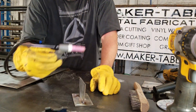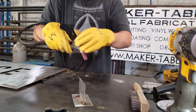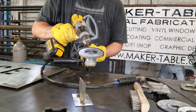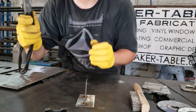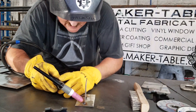Did you hear that? No gas. So my tungsten is contaminated and we're going to have to stop here and sharpen it up. Let's try this again — turn on the air. That's the biggest weakness of this TIG rig setup: the argon does not turn on by itself.